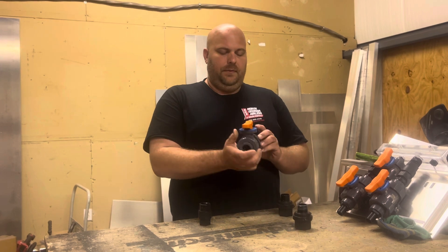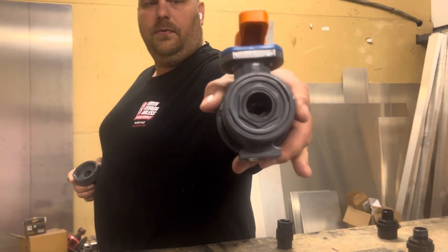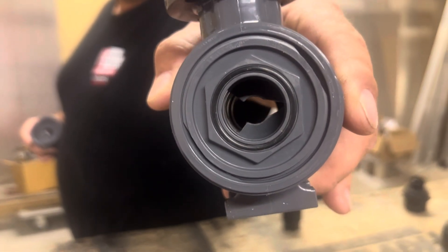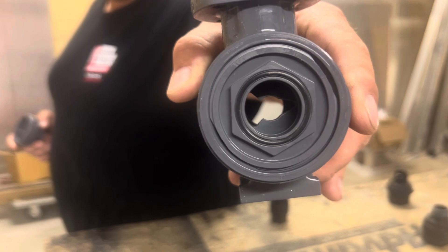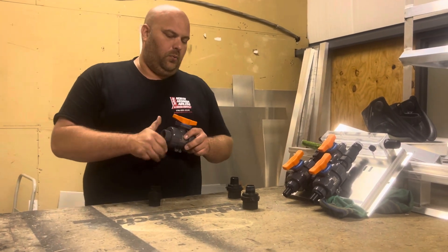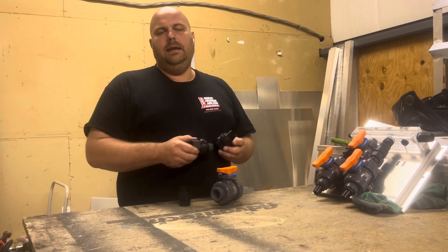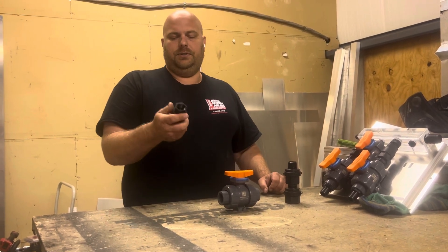This is a one-inch valve. The ball inside that valve is restricting the flow — in no way, even though this is a one-inch ball check valve, do you have a full one-inch flow orifice. Therefore, you don't necessarily need a full one-inch check valve. The one-inch sizing is why people use these Banjo check valves and other brands, but it's simply not needed when you already have a flow restriction that is greater than the flow restriction coefficient of this valve.